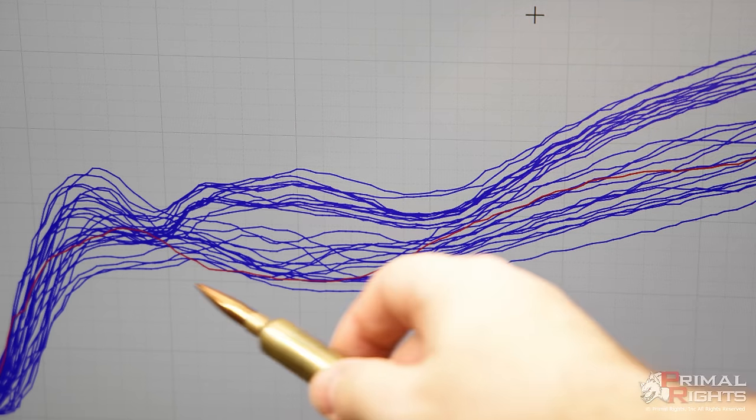I'm not ready to reveal exactly what I'm doing there yet, but this tool is very good at finding disparity or confirming that what you're doing is providing a good result. What we're looking for is a very nice uniform application of force with all results staying very tight to each other in terms of pounds of force applied throughout the curve. Specifically, the start point of force being applied and the variance we see in it is where the case length variance is borne out in the bullet seating aspect of things.